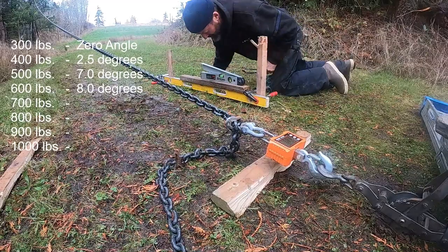At around 9.8 degrees, this is a very important part of the test because I believe it is simulating with pretty good accuracy the conditions during my so-called deep-set test. I've tested over a dozen anchors under these conditions in a very firm, sandy mud seabed, and most of them pass the test with flying colors — they dive out of sight and hold rock solid. However, there were three anchors that were not so good: a 45-pound Delta anchor, a 10-pound Fortress FX-16, and perhaps most unexpectedly, a 45-pound Rollbar Rocna that repeatedly released during this test.